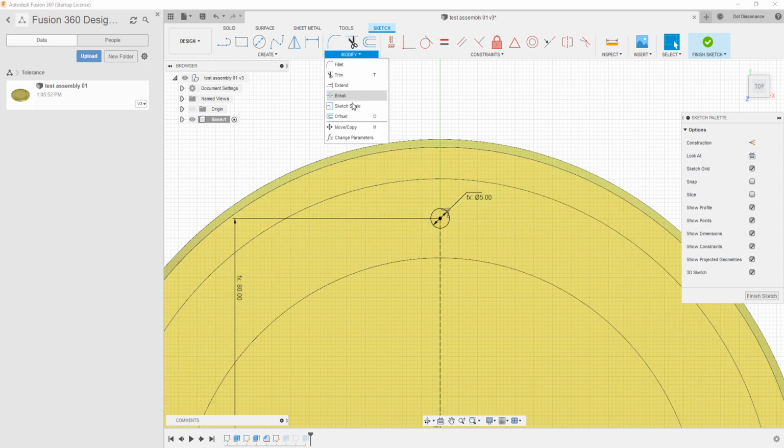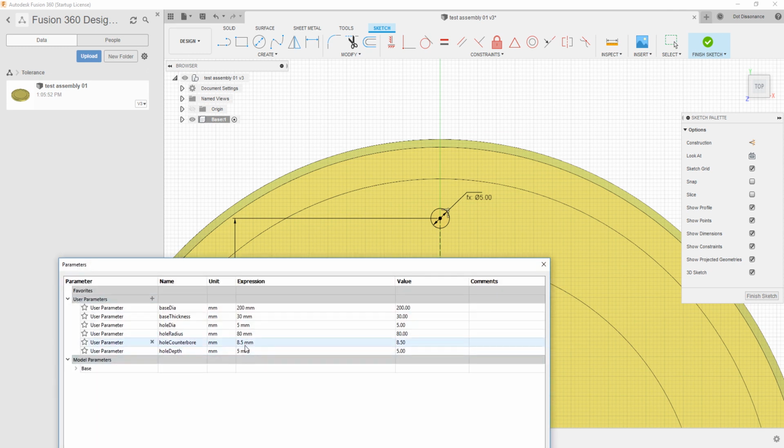We can set a parameter and you can say, well, okay, I want it to be 5. How about 5.1? So we'll say 5.1. As soon as I hit enter, you'll see that that changes. And then maybe you go ahead and make a prototype and then you check it for fitness and you see, okay, well, does it fit? Is it too loose, too tight, whatever, right? And then you keep changing and keep changing until you get there, okay?